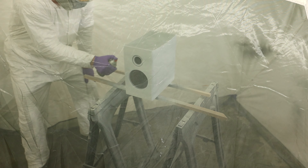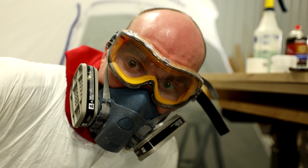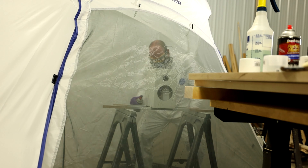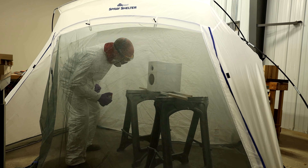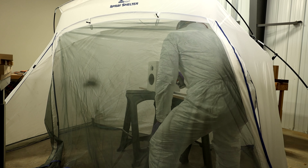If you're not familiar with this little spray booth, I'll link it below — it's really handy for small to medium sized projects and helps control dust contamination and prevent overspray. A little reminder to wear your PPE. Today we're spraying the clear with a 1K finish — not nearly as toxic as a 2K clear, but you should still protect yourself. The clear coat went on over three coats, with the final coat as thick as I could without any runs. The 2K will have a major advantage when wet sanding the final finish, especially for a piano black finish. If you're not comfortable handling 2K clear, an auto body shop can easily take care of this step.